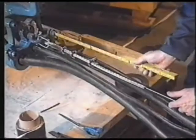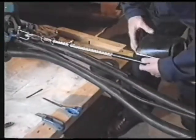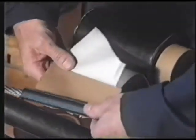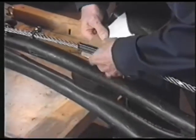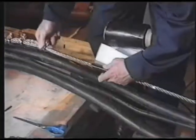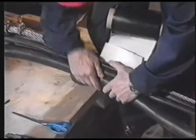Once again, make sure that the nuts on the wire clips are turned away from the cables. Measure the location for the first plastic tube, which shall be 500 millimeters away from the lifting eye bolt. Make sure that the cables are parallel. Start by wrapping the vulcanizing rubber tape one turn around the plastic tube. Then locate the wire, the tube and the cables and keep wrapping on the vulcanizing rubber.